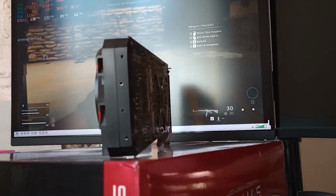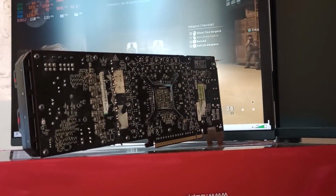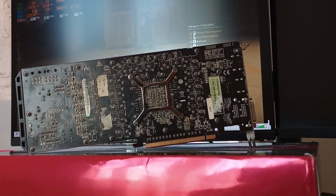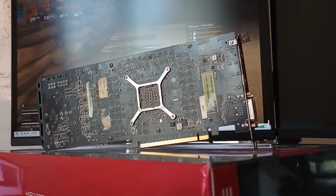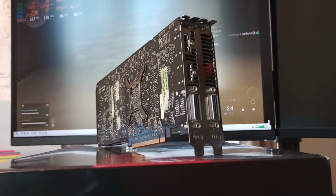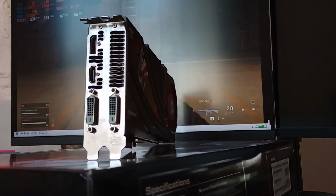I will end this video with a warning though. Baking the card, using the heat gun, reflowing or reballing are not quite proper fixes. Yes, the device will run again, but typically not for long. It might, however, be just enough to keep you going until you get a proper replacement.